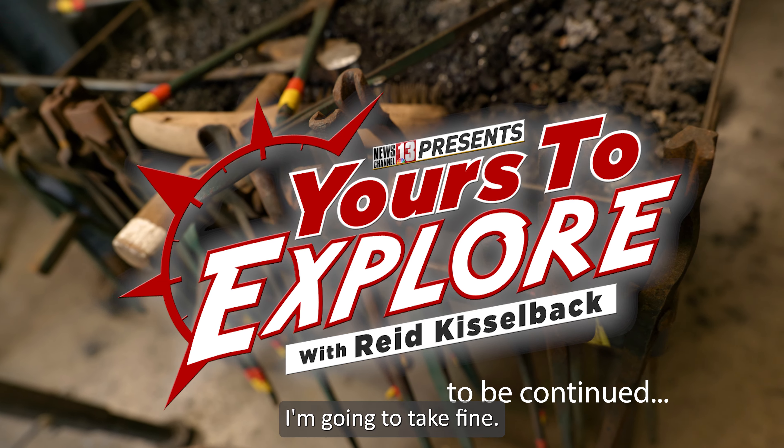So you're going to come out here with the rounding hammer on the anvil, and you're going to go like this. See how that's rocked up? You're going to hit it right there a couple of times, and it's going to make a little step. Hit it right at that point. See what happened there? You had drawn it out too far, so by hitting it on the edge, you basically upset it again and put it right back to the thickness you need. It's one of the neat things about metal — sometimes you can recover from those things.